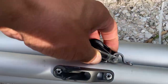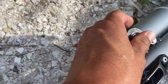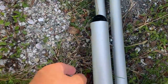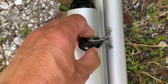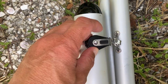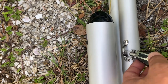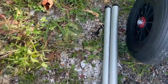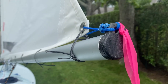They have a split ring here so you can take off the block and replace it. This one would be on the front, and then you have this one here which has a swivel. These swivel blocks with these bearings are now class legal because they're supplied by the builder — Laser Performance is the builder, the brand is Nautos. You cannot use a Harken block with ball bearings; if you're going to use new ball-bearing or these new blocks, you have to use this brand.